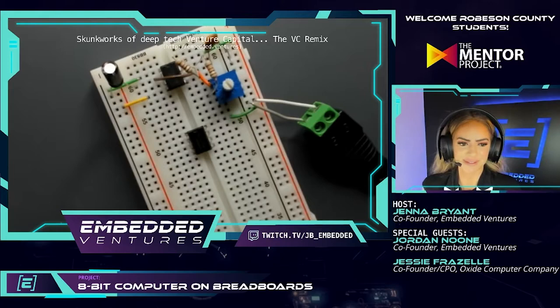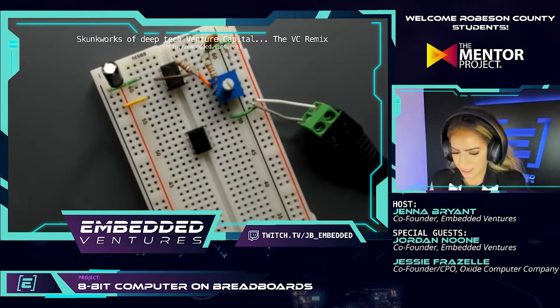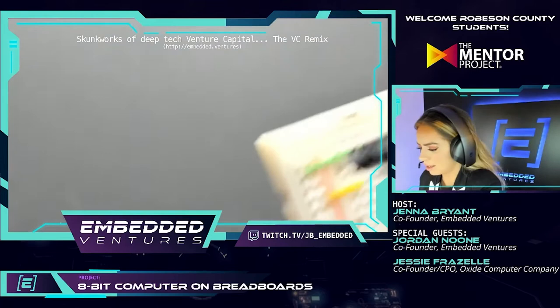Let's jump into pin 1 — that's step 2.1.4. We're going to connect pin 1 to ground. In the current position it's kind of the top left corner, and it'll be the same as what you did on the first 555 timer. I should make sure it matches — I did green and yellow on the first one, so I should do green and yellow again.